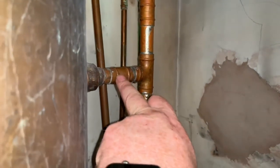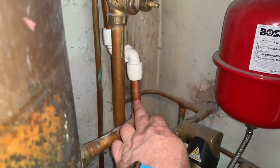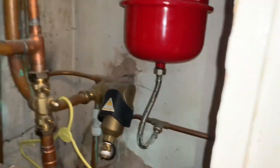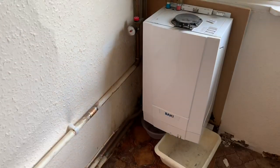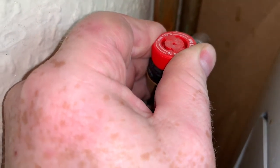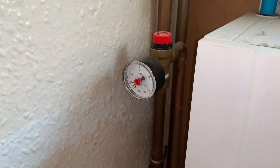That cylinder will be empty on this side. This side is the heating coil, and often what you'd find is these pipes here will gravity feed and they will be cold feed and expansion. But on this system it's been converted to a sealed system, so we need to drain the heating down. It's got a pressure gauge on, so we need to drain the heating down before we can take the cylinder out. The boiler's in here with a pressure gauge and a PRV there, so what I'm going to do is open that. You wouldn't normally do this in normal use because that might start to leak afterwards, but it just makes it easy for us to drain it down.